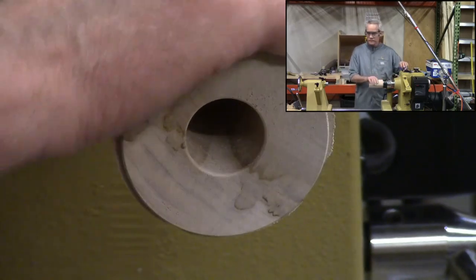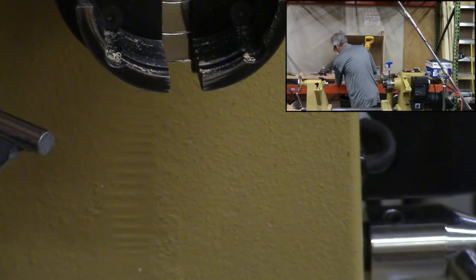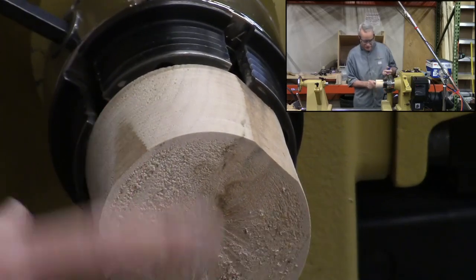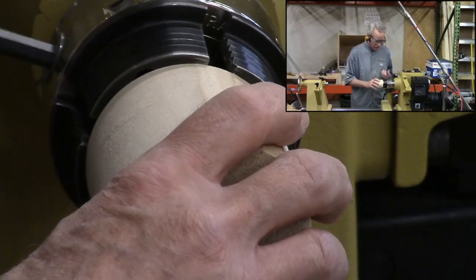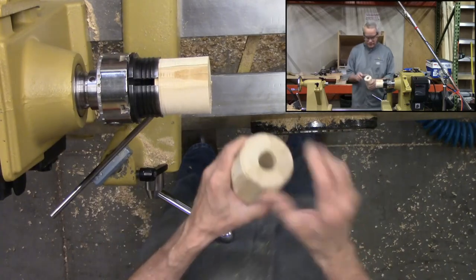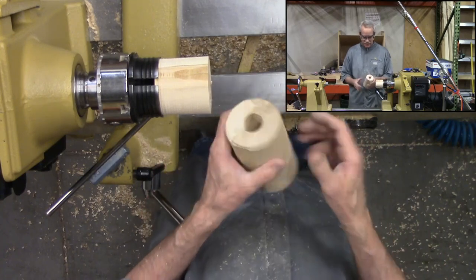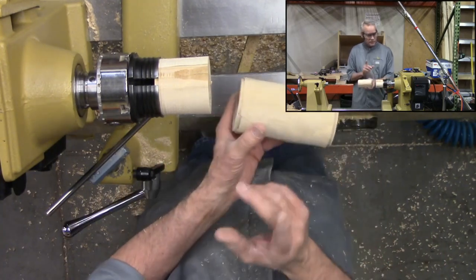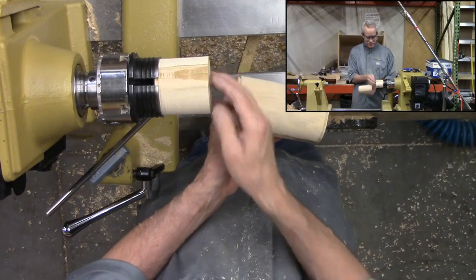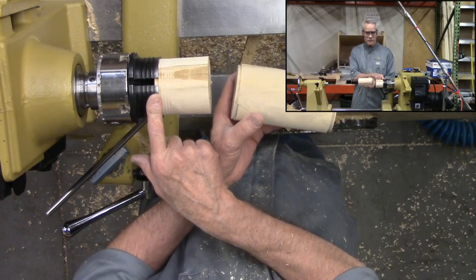Put a little bevel right here again, just a small one. I'll start that bevel with 400 grit, fold my paper in thirds, and curl it just a little bit — that stiffens it up. Because I just made a chamfer, if you stiffen the paper, you'll sand just the bevel. If I just went loosely with the paper, I'd probably round over both edges of the bevel. You could put sanding sealer on it and that's the base done.